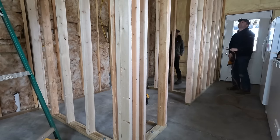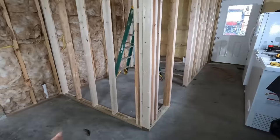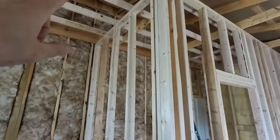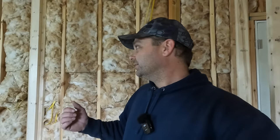Now we got to attach the top. So we just finished up the framing. You can see we've got our doorway framed up here going into the solar power room and we also got the ceiling joists put in as well. So the next thing I want to focus on is the inside of the solar room. I bought some 5/8 inch plywood and that's what we're going to cover up three of the walls with — that's going to give us a nice solid surface to be able to mount our equipment pretty much anywhere on the wall. And then I'm going to cover the entire room with drywall. I'll get a little paint on it and cover up the screws — I think it's going to make the room look fairly nice.